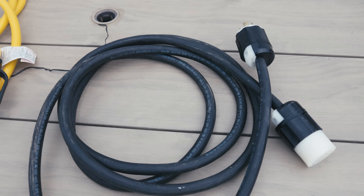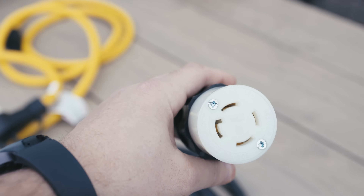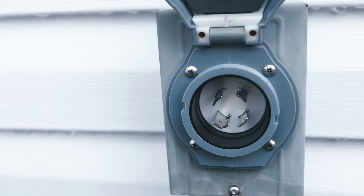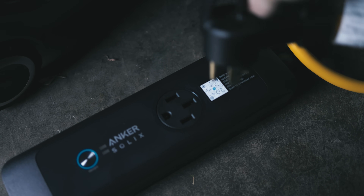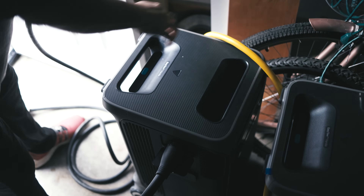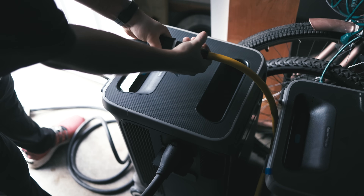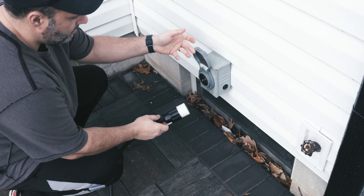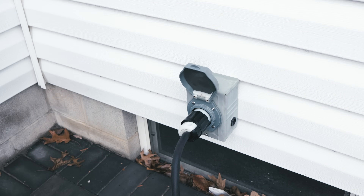Here's the 50-to-30 cable — the reason I bought it from Amazon instead of making it myself is I just wanted it longer and I already have my generator cable, so I'm just going to hook this to that. You can see the four-prong right there with a little key. Very simple to hook up. This is the part that's going into the house — this is my inlet switch. These cables are going to go into the house and back-feed that panel. I'm going to take the one end with the 50 amp and plug that right into the power hub. That's a pretty heavy-duty cable — I was impressed with the quality. Now I plug the generator cord into the 50-to-30 amp adapter, then take the cable I already made for the previous generator video, plug it into the inlet switch, line it up, twist it, and that locks in. Everything is water resistant if you hook this up right.